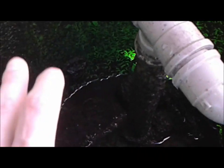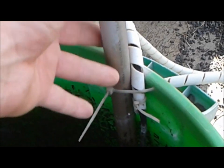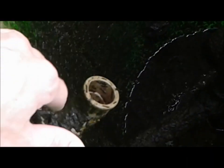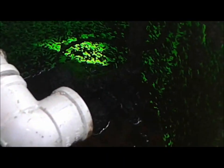This time I'm going to be making a few changes to make the design more solid. The radial flow filter discharge pump, instead of a pipe popping out like this, this PVC pipe will actually go to a flange like this one right here, and it will stick out on the outside so I can connect hoses like this one. I'm also going to remove that water tap there — there is no need for that since all the cleaning is done by the radial flow filter pump anyway.